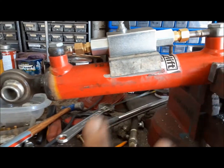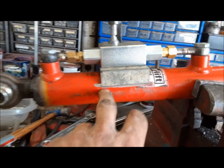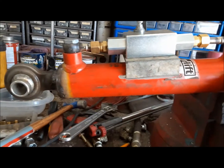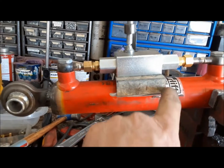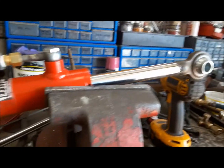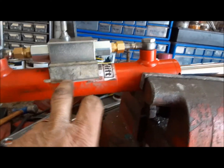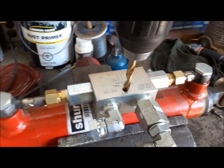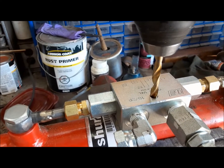You have to be careful — you don't go too crazy welding these on, because if it actually penetrates through the wall and makes a mess on the inside of the bore, you're going to screw up your cylinder. We've also gone ahead and made sure the ram is extended all the way so the piston seals are nowhere near where we're welding. Now we're going to drill down through here through our little bracket so we can put a nut and bolt to secure the valve.